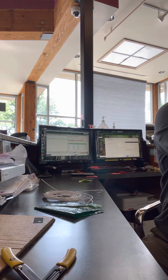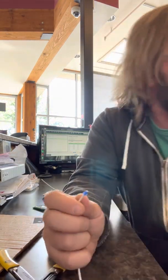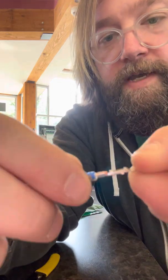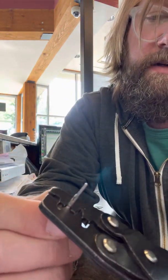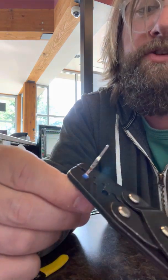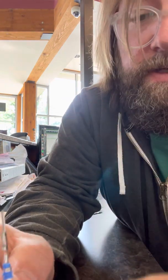But my thought is, once I get that seal on there, now when we have the terminal being crimped on, is once you have it crimped to the core part of the wire, and then when you go to do the insulation portion or the sealed part of the terminal, it's most likely that it's too round, where you need to make it more oval shaped.